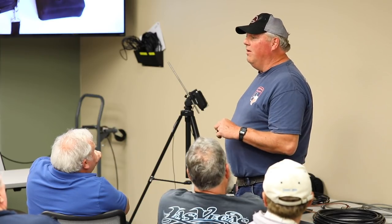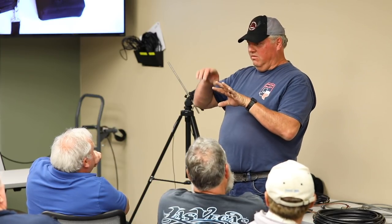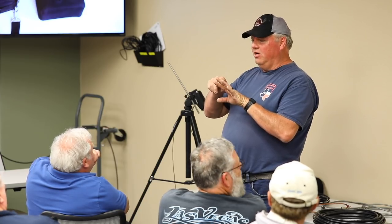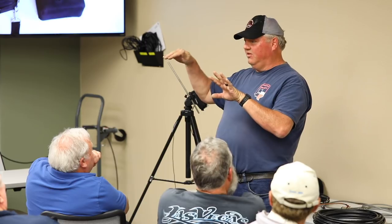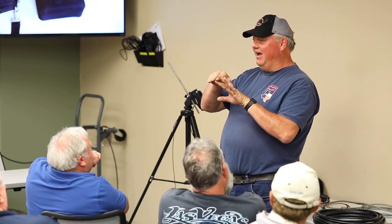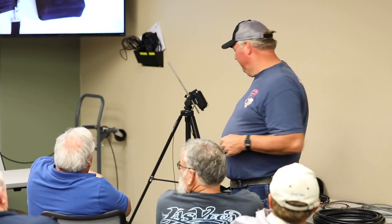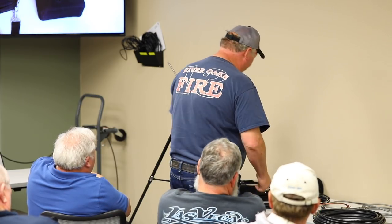No worry. Keep in mind, even multiples of a half wavelength work. So you could go 2, 4, 6, 8, but you can't go 5, 7. Or you can't go below it. No, not on this stuff. So that's a piece of coax right there.